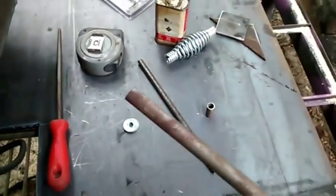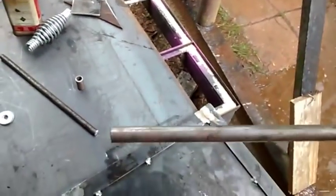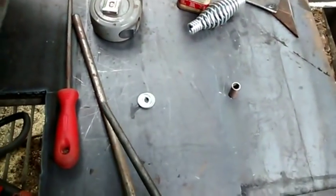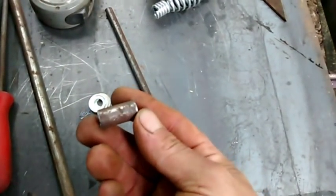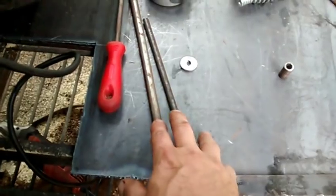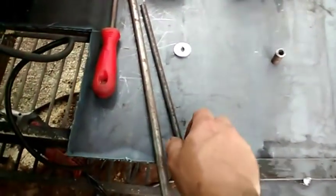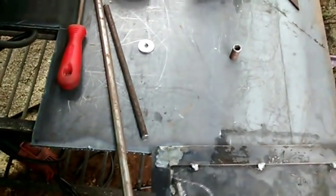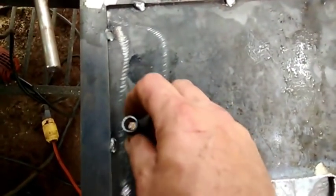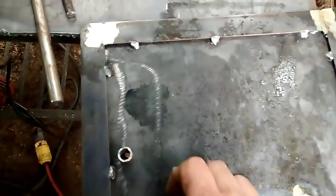So anyway, what we got — this is some half-inch round tubing with about a three-eighths diameter inside diameter. This is some three-eighths round stock, just solid bar, and that fits real good inside there. I've already cut a little piece off, about an inch long, for what I guess you could call a bushing. This is really the key part right here — this has to fit right. If there's a lot of play, a lot of slack in it, it's not going to work. It has to fit tight, almost to the point where it'll barely turn in there, but it still turns. That's the key point. So I've got to finish drilling this hole up to a half inch to fit that down inside it, and then we'll get to bending.